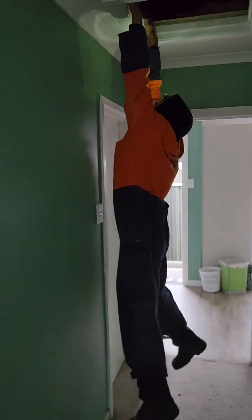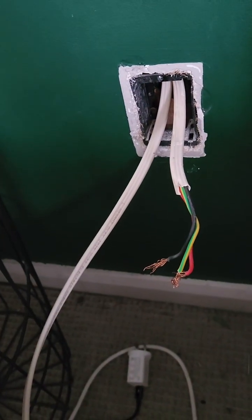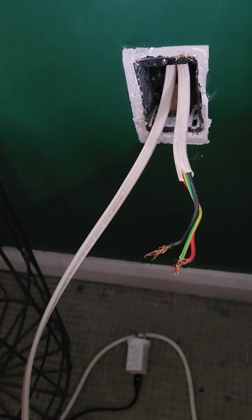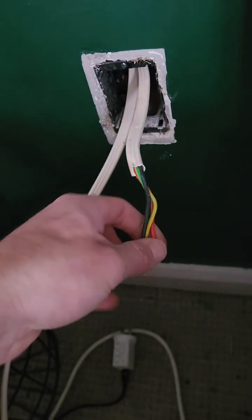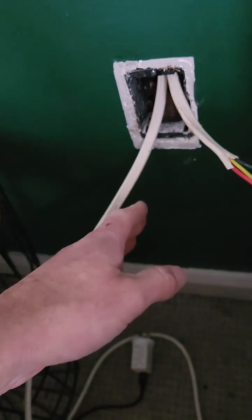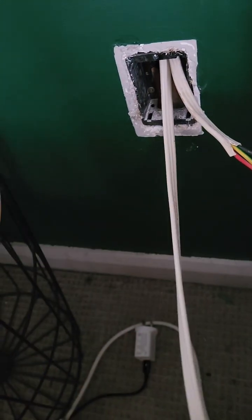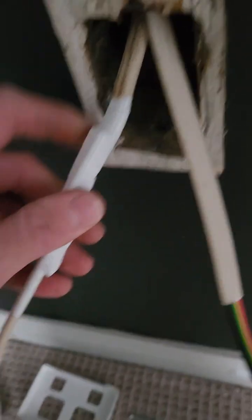Nobody's home so that's all good to stay like that until we rewire it. First cable on its way to its new destiny! As soon as I start videoing he stops pulling. We did a copper join on this one — I'll show you on the next one. A copper join means you can pull a lot harder on the cable rather than just taping it. This one went up pretty well so I just taped it.